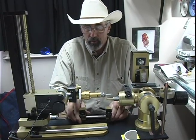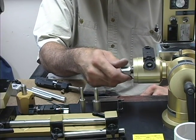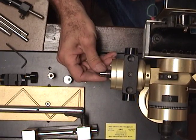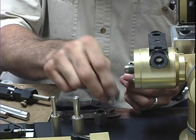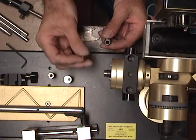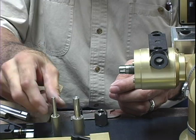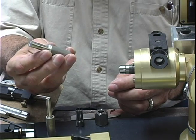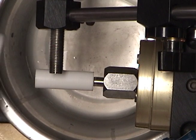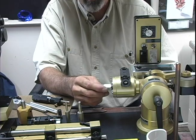Then replace your stone and begin cutting. The next stage we're going to look at is the collet system. The OMF machine comes with a standard quarter-inch collet — these are interchangeable, and also available is a 3/8-inch collet. I've also got a quarter-inch mandrel for doing the cutting, and available is a 3/8-inch mandrel as well. Also available in Corian, which is a very fine polishing lap. I'm going to start off with the quarter-inch collet.